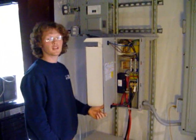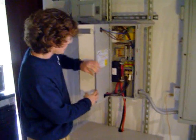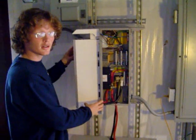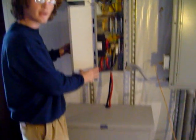There are basically only eight connections that have to be made to make this unit function. Power comes into the e-panel via a 30-amp breaker in the main panel. The energy is then run through the inverter and transferred to DC power to charge your batteries.